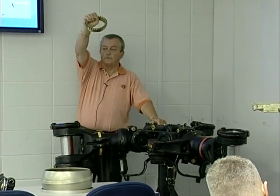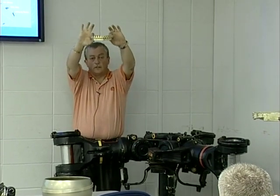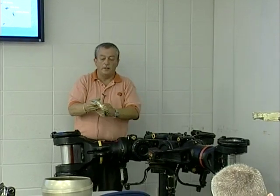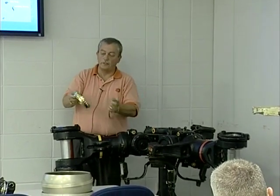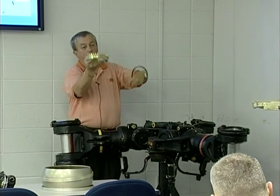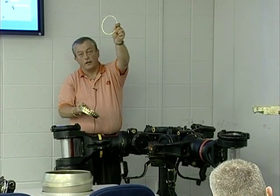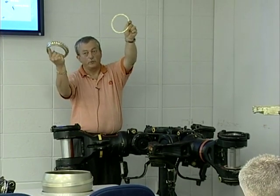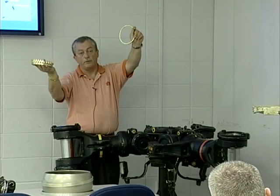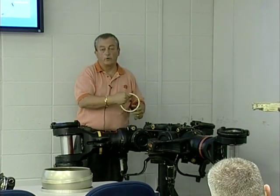The retaining nut on top of each one — this is called the Jesus nut or retaining bolt. Once it is placed down and torqued, there will be a little spacer washer that fits in the slots to keep it from backing off, and then there's a snap ring. There is a tremendous amount of torque placed on this, and you'll see them out there with large tools — the torque multiplier.